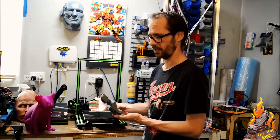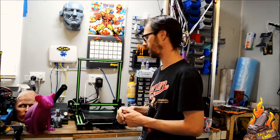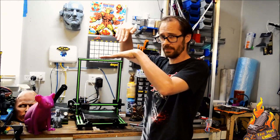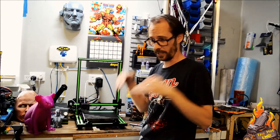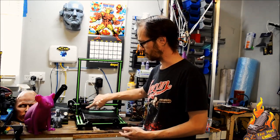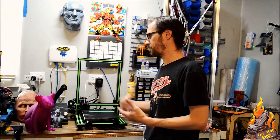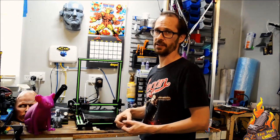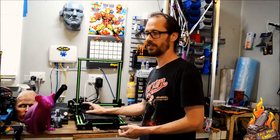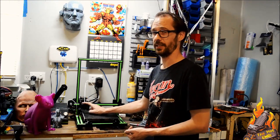The reason the cooling fan doesn't do very much is: one, the outlet is about one millimeter thick, and two, they've placed it above the nozzle. It really needs to be airflow pointing at the print, not at the nozzle. So with that, plus the actual box they put around the extruder, they've created a little tiny vortex of air that blows straight down over the hot end. The problem is this actually prematurely cools down while we're printing. If you set this to 230, you're lucky if it gets to 205 or 208. I set this to 250 and I couldn't get it past 220.